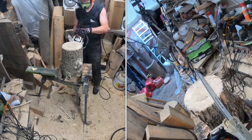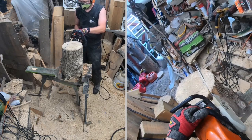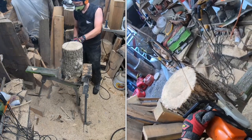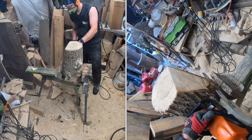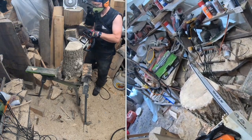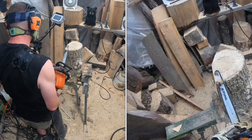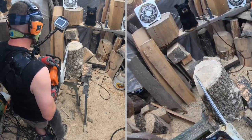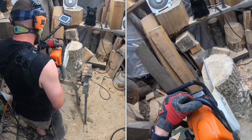Hopefully your saws are sharp, gassed up, safety gear is on, and you're ready to go. Our first cut is going to be about two inches in from the back of the log — we're angling the bar down and back. This will be the back of the head, back of the ears, back of the bear. Finish that cut down to about the top of your jaw horse area. Now we're going to clip off this corner — that'll be the back of the ears — then jump to the other side and do the same. Then make a straight cut across about half the height of the bar if you're running a small bar.